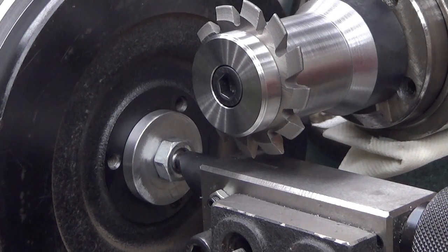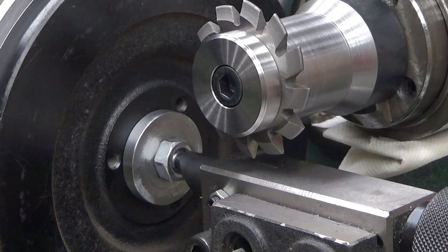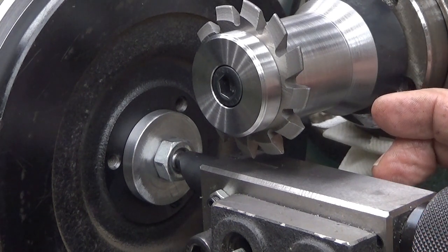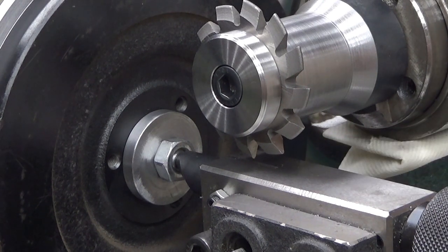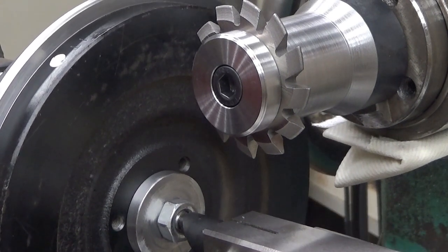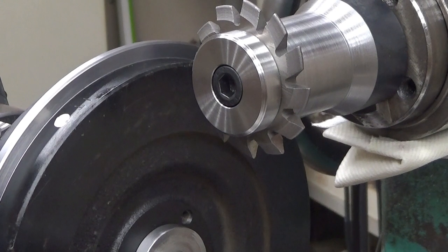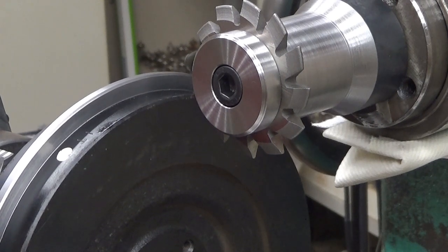Well, here we have a groove here in this tailstock. I'm simply using it to visually align this blade into that groove, and now, well, I have already aligned it. And there it is. Next step will be... I switched this thing on. Next step will be to set the correct depth of cut. And this is... Now, let's see. So, of course, I lock my Y direction at this point because I don't want it to move anymore.